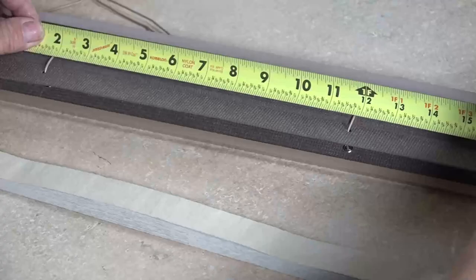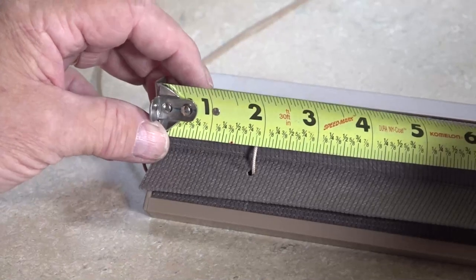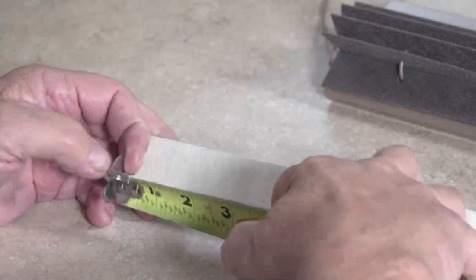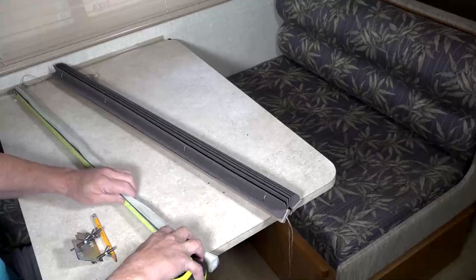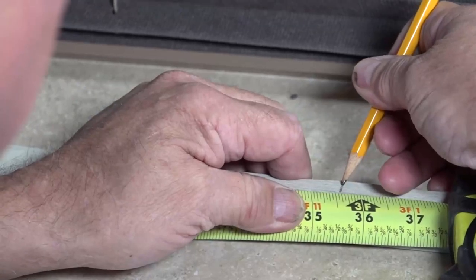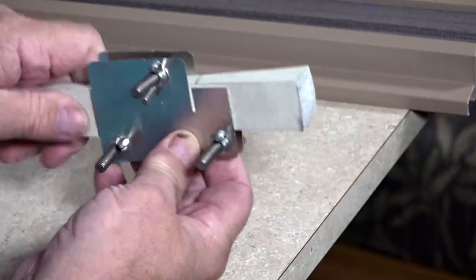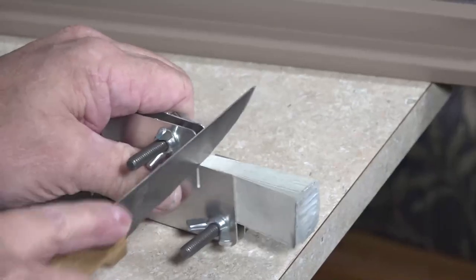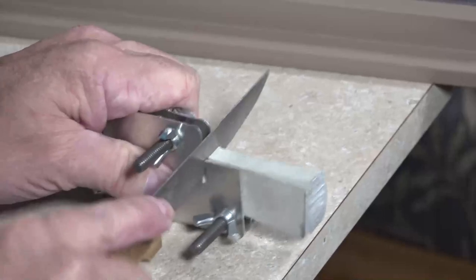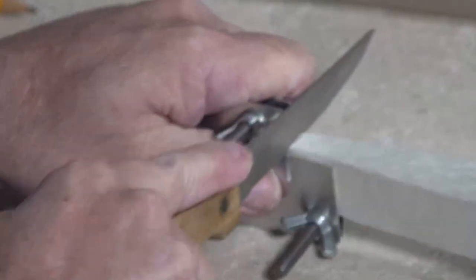Notch fabric to fit around cords. Determine where cord notches will need to be cut in the blackout fabric by measuring from the left edge of your existing pleated shade to the location of the first cord. With the blackout fabric folded together and tan side up, measure the same distance from the left edge and mark cord location with a pencil. Measure and mark all remaining cord locations — depending on size, there may be two or four cords. Use the fabric cutting guide, aligning each pencil mark with the notch slot. Using your kitchen knife, carefully slice through the pleats on the tan side, cutting to the bottom of the notch in the template guide. Reposition the template and repeat for remaining cord locations.